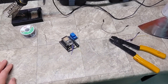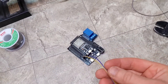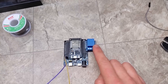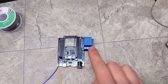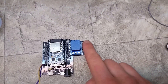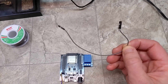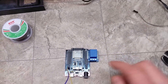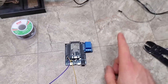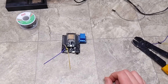All you need is a little screwdriver. You press down on the little orange terminal underneath and you can put wires in and out. It's really simple and a very quick install. Now that we are done with the wiring in the garage, I've come inside to finish the soldering on the circuit board. I need to get ground and voltage to the relay, and then a signal to the relay as well — that should be the only soldering needed.